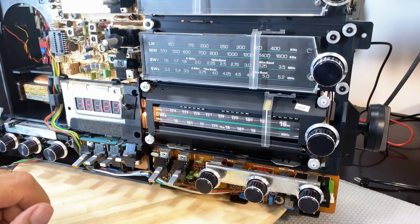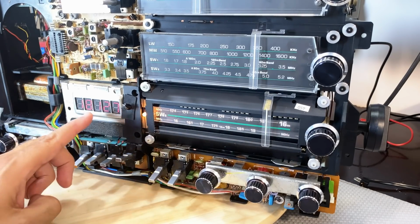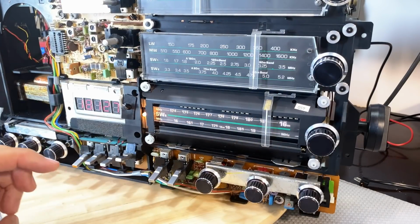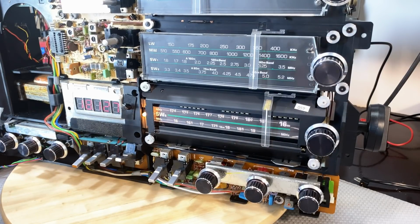I would expect it's fairly close, but as I said, I've got a feeling, just a feeling, looking at the medium wave figures, that this might have shifted. Well, not this, but the whole tuning might have shifted 1 or 2 kilohertz, but we'll find that out later. I'm not sure if there's a way of adjusting this. I haven't got to that yet. But yeah, I think this is done. This part is done. So the AM alignments, the IF and the oscillator for 2.46 are done. I think the result is positive.